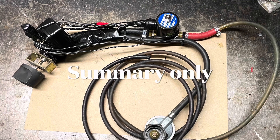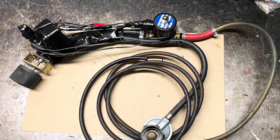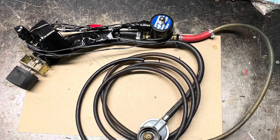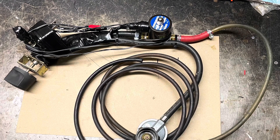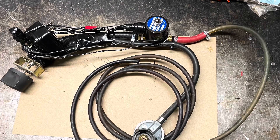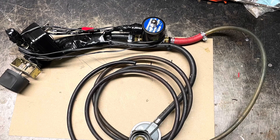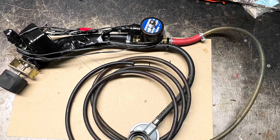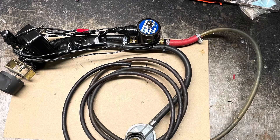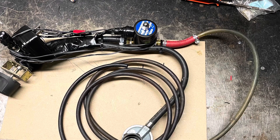This video is not intended to be a step-by-step tutorial on how to make this conversion, but rather a summary of how I constructed a backup fuel source for my generator. The objective is to automatically shut the fuel source down if the engine should quit for any reason — otherwise gas would continue to flow, resulting in an explosive condition. In addition, propane is heavier than air and should be injected above the inlet to the carburetor, or an unsafe condition could result when starting the engine.